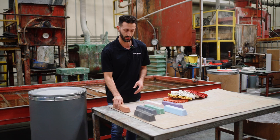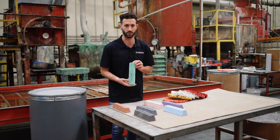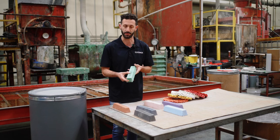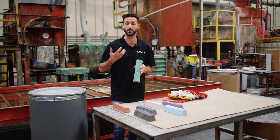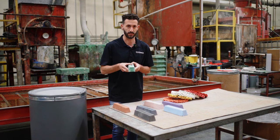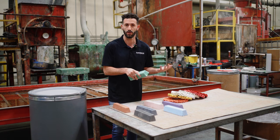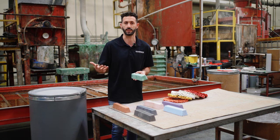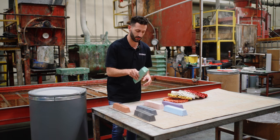From this step, you would go into a second step, which would be the green rouge. The green rouge is one of the most popular bars you can get — almost every industry uses this one. It's a finer finishing bar and it has green chromium oxide in it. When you're polishing aluminum, it's going to give you a slightly darker, richer luster. This would be your second step, paired with either a stitched buffing wheel or an airway buffing wheel depending on your preference.